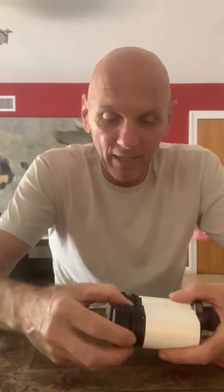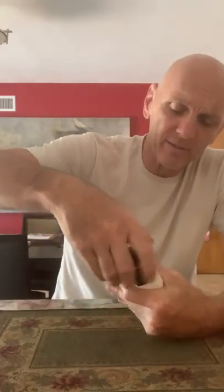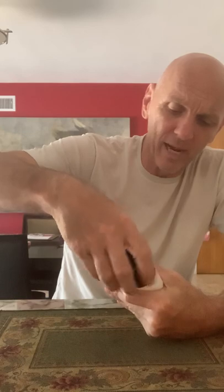What I found when I wasn't able to merge the images was that if I loosened up the right side and lifted up the eyepiece — you can see here when I put an eyepiece in and lift it up just a little bit — the image was merging nicely. So I knew that either this side had to go up or the other side had to go down. To adjust this, you need to remove the eyepiece holders.